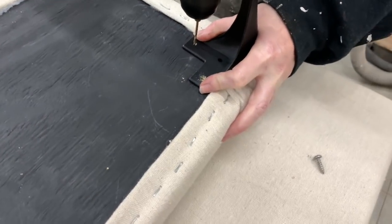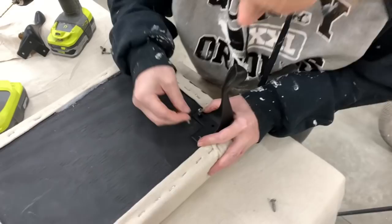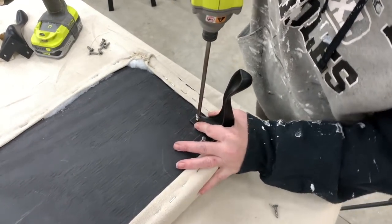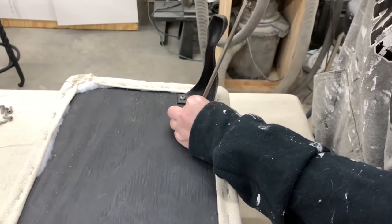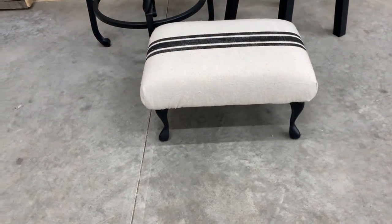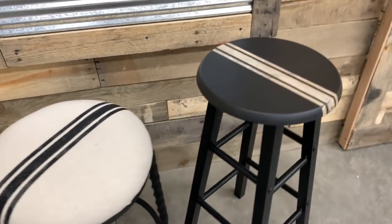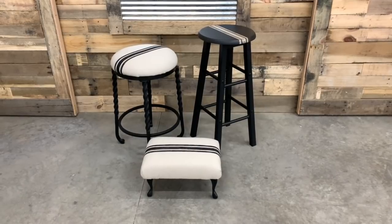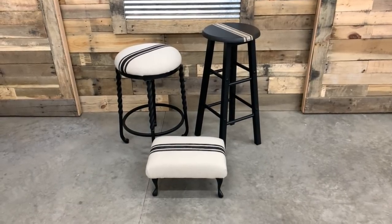Now replacing the legs on this footstool — I flipped that piece of wood over so there are no holes, and this had that piece of paper glued down flat to it, so I actually have to inset the feet a little bit because I won't be able to screw into the fabric. That's okay as long as all four feet are level and equal to each other — this will work out just fine. If you are new to my channel, as a reseller and maker of YouTube videos, I consider ourselves a how-to channel. That's why we go through the step-by-step procedure. I don't just show the before and after — this is the how-to if you want to resell thrifted items yourself, or just want to make over thrifted items for yourself.